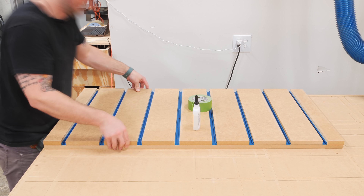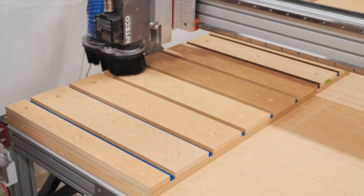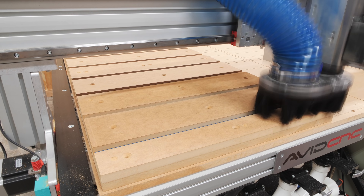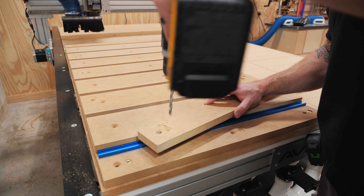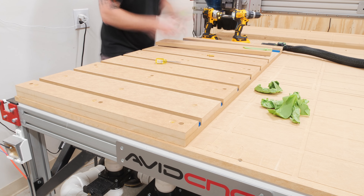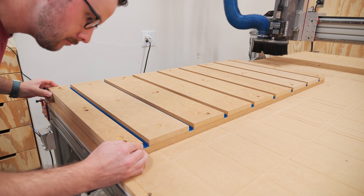I ripped the strips a little too wide initially, hoping for a snug fit, but ended up with an impossible fit, so I had to trim them slightly before mounting. To hold the strips in place while the CNC cut the mounting holes, I used the painter's tape and CA glue trick instead of double-sided tape. After mounting, I chamfered the holes before drilling them since I already had the V-bit installed, and also drilled some clearance holes so I could remove the screws holding the entire table down without removing the strips. I used brass screws to hold down the strips just in case I accidentally run the bit into them when cutting, and swapped to steel machine screws for mounting the table to the spoilboard since those are below the strips and easier to remove magnetically.